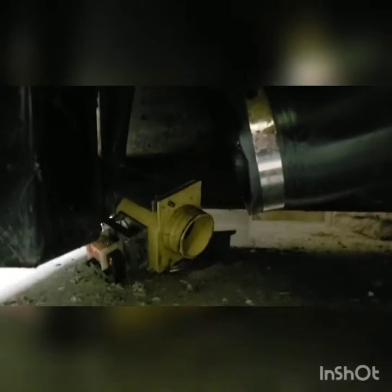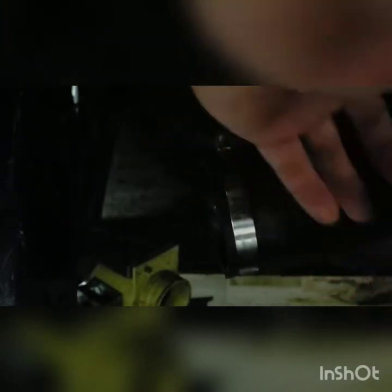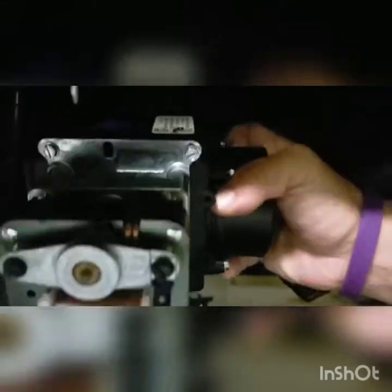So now we're going to put our new drain on. So shiny and new right there. Basically just going to reverse the process. We're going to fit that on there, put our hose clamps back on, reattach our wires, and don't forget that metal L bracket that'll hold it up.